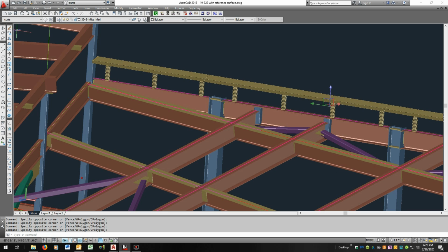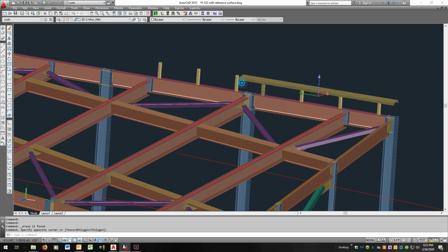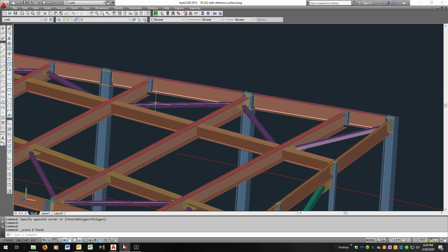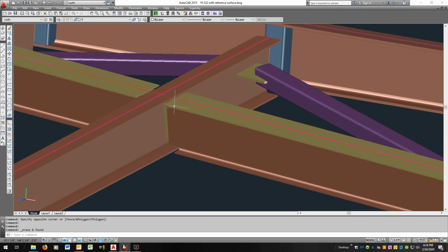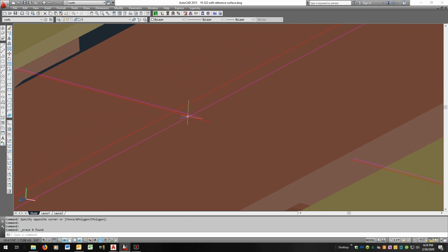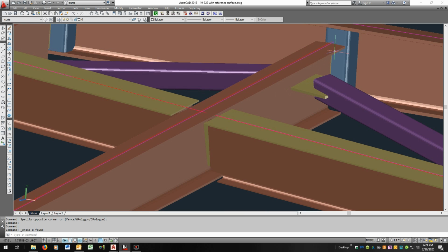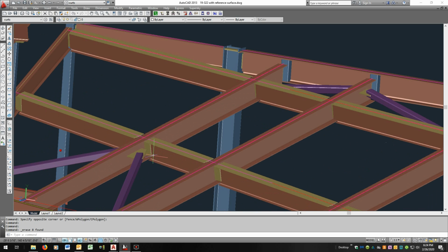They have gone with a different design, and it takes away a lot of obstruction to what we can look at here. So the channels come off, and there we are. Now we can see that this purlin plate is flush with the tube. These lines that you see here, one of them is a wireframe from my skylight drawings. One is I just added lines going center to center of all the members, and I can compare the lines quicker.